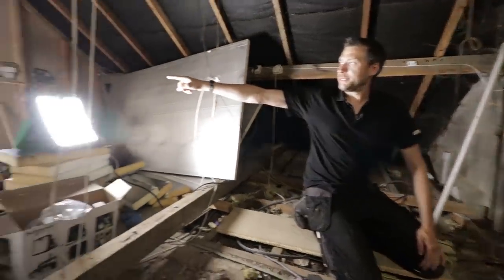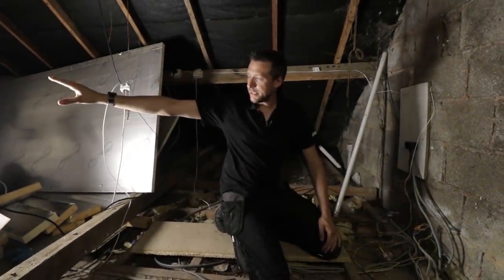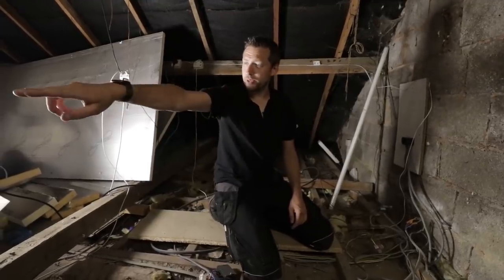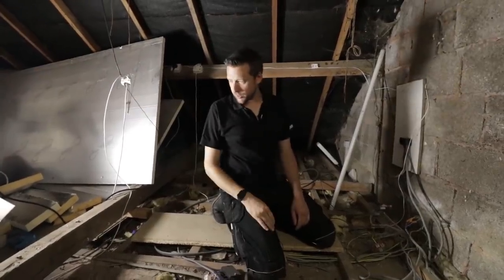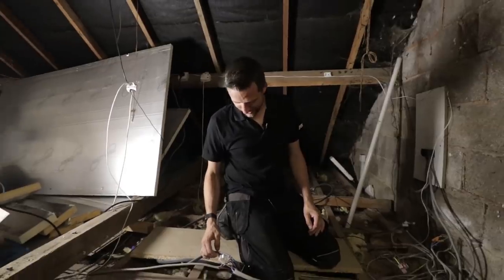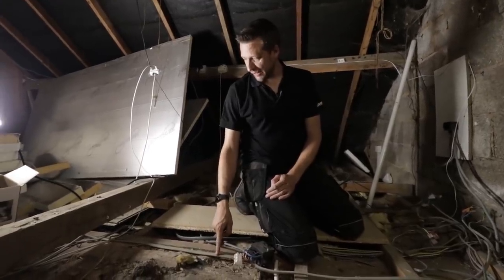See where the boiler is over there - the board is going to go somewhere next to the boiler. We've got to work out what all of this is, and we're basically going to extend it behind where you're looking at me, run all the cables in the eaves over there, and it's all going to be boxed in afterwards. I've got a 10 mil here which has been split - I don't know where these two go. I think this is one electric shower, but I'm not sure.